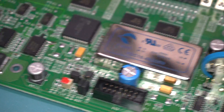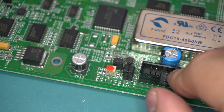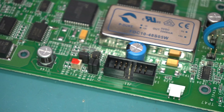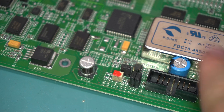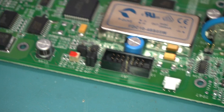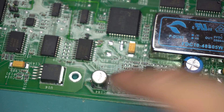There's some power supply stuff here — this is a 5-volt 2-amp output DC-to-DC converter, a couple of jumpers, and a pot. This pot is right next to the connector for the LCD so it's going to be contrast. The jumpers will probably set settings on the board or maybe even define what kind of LCD you're using in case they have other options. There's a backup battery. There are only three electrolytic capacitors on this entire board, which probably makes it pretty reliable. There's no fan and no separate power supply other than the DC-to-DC. These are electrolytics, not polymer caps — you can tell because they have a little vent groove cut into them.